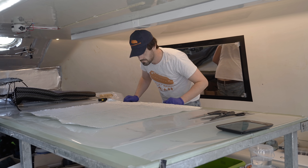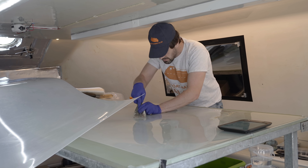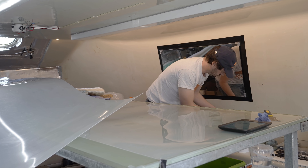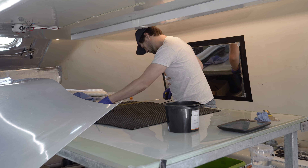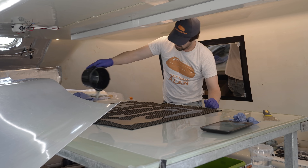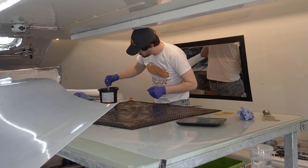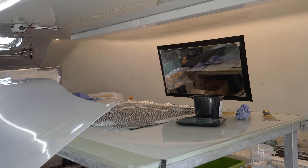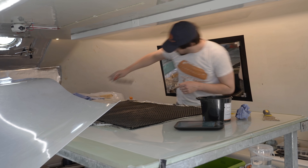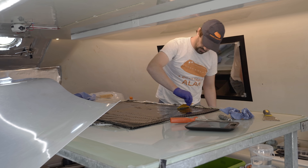I recall some sabre rattling in the comments in a previous video involving fibreglass, and I have a shootout between different types of it coming up in future weeks. There's no mould as such but I need to prepare the surface properly before getting any resin involved. I have two thin sheets of polypropylene plastic - huge glass sheets would be better as a non-stick surface, but there's a massive difference in price and weight. Any contamination or old flakes of resin will affect the cure and the finish, so a combination of chipping away old residue and then a wipe down with acetone preps the surface perfectly. I'm mixing up the polyester resin with an accelerated MEKP catalyst at 2%, so I decided to make three batches so as not to end up rushed and risking the chance of the resin gelling before I'd finished. I can be fairly liberal with the first load as any excess will soak into a second layer in the sandwich once rolled and compressed. The three layers stack up quite easily and I'm trying to limit any air trapped, as rolling and pressing air pockets out can be a pain. The glass fibre drinks up resin more easily than the carbon, but all you need to ensure is a full wet-out of the fabric without going overboard.